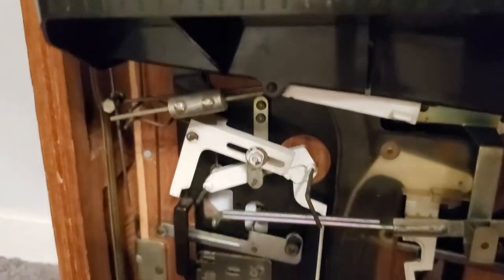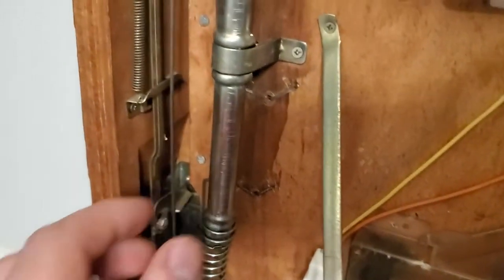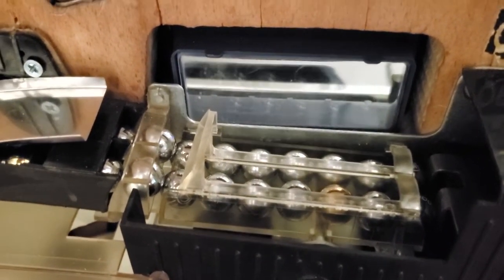Here I'm going to quickly show you how the jackpot balls feed down through this tin tray into this mechanism. All these adjustments are rigged up so that when these balls are out of the two tracks and they don't compress those two little white levers down, it'll pull this mechanism here and actually load the balls into your second tray. Then they'll eventually filter down into your little jackpot chamber.